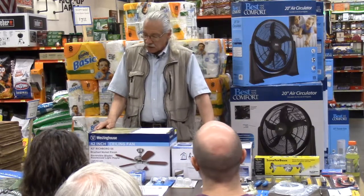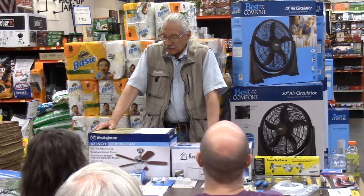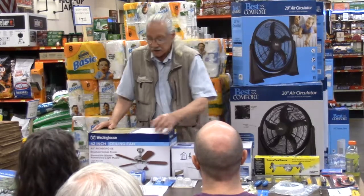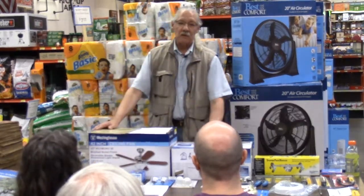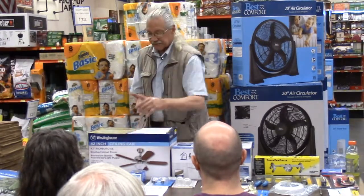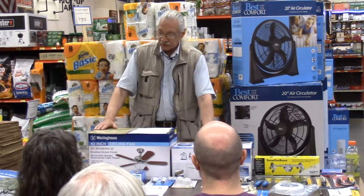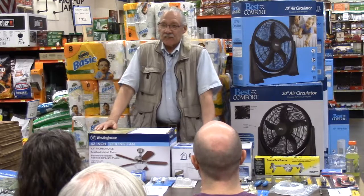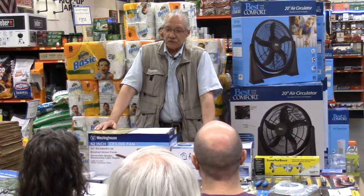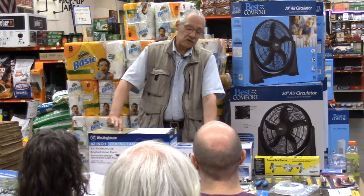If you have to pull new wiring, or you're installing new wiring, obviously you're going to want to make sure that you have the correct amount of wires based upon the switching you're installing, whether it's a hot wire, 2 switch wires, light and fan, and the neutral. Most installations now, especially with some of the smart switching, these switches require a neutral in that box, which is not true of a lot of older switching that just required the hot and the switch wires.